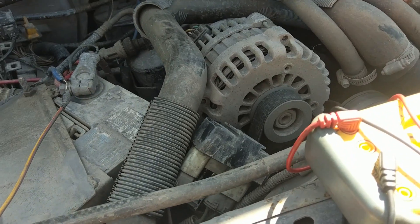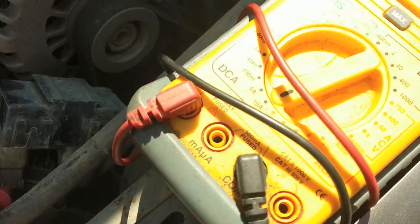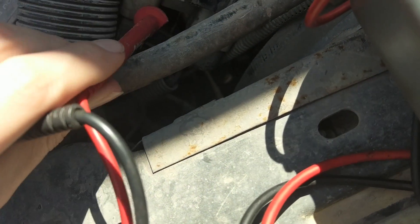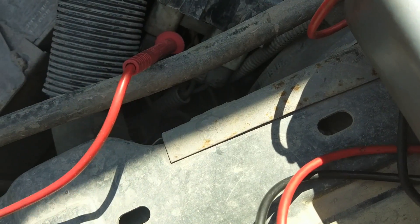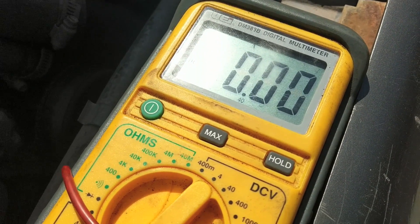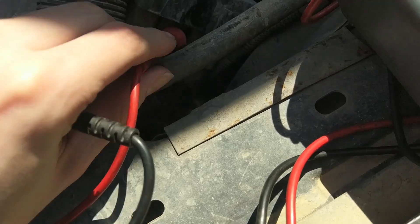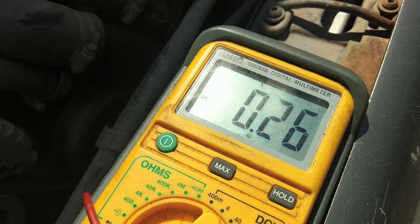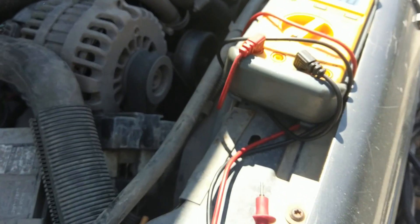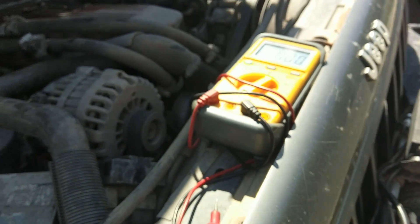We want to see how many amps it takes to actually run those coils. I pulled the connectors out and all we've got to do is set our meter onto the amp range, then touch one terminal and ground the other. On low, it takes about 150 milliamps. On high, with both of them, it's like 250 - almost 300. But still, that's pretty low. It looks like one of the transistors I have laying around should be able to support that, since it has a maximum 600 milliamp current capacity. So we should be good.